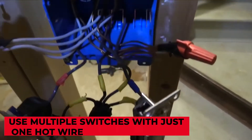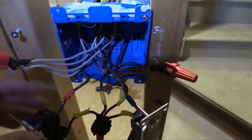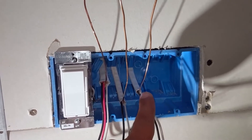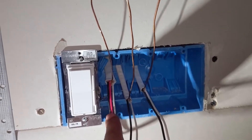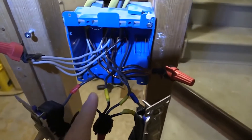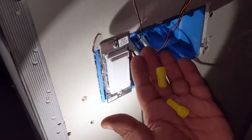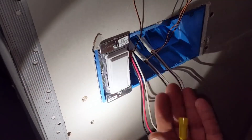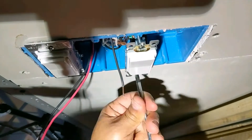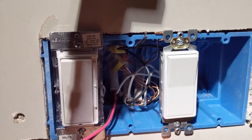A hot wire box packed with three switches can be overcrowded without adding further wire connections and pigtails. Electricians created a wiring method that eliminates splices and makes installation more aesthetically pleasant. Instead of running a separate pigtail from each turn, they leave the hot wire extra long, use a wire stripper to slice the wire and force the insulation away, revealing about three-quarters of an inch of bare wire to connect the switches. The bare section is wrapped at least three-quarters of the way around each switch's screw terminal, repeating for each intermediate switch.